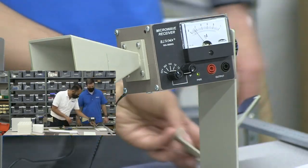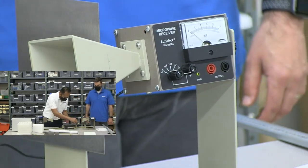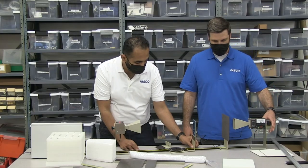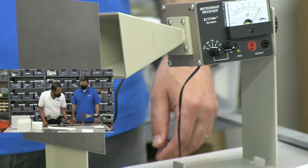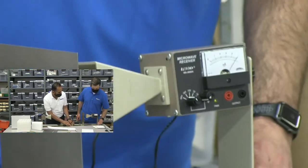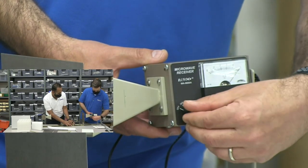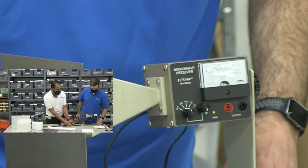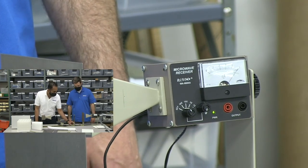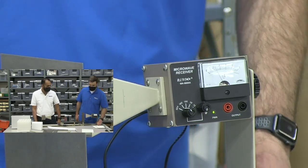And the proper way to measure is actually two of those half-wavelength distances. We can just slide this back and forth and see the intensity change. There's a maxima right there. There's a minima right there — that's the point where we have a standing wave. As I sweep across, about 1.75 centimeters later there's another maxima, and as I go again, there's another standing wave.